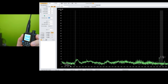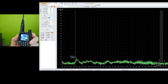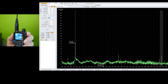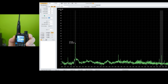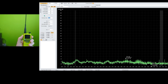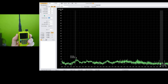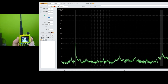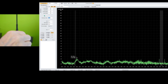All right, here's another H3. Pressing the PTT button again. And this one's not as bad, but it's still bad. The second harmonic is down about 25 dB, which is not good enough — not even close. And here's the newest TID radio in its lovely lime green color. Pressing the PTT button, and again the second harmonic is down maybe 20 dB. The third harmonic is just about as strong as the second harmonic. So it's just not worth it.